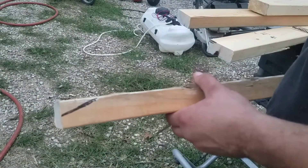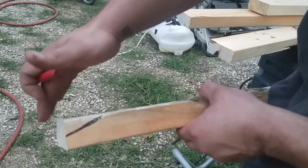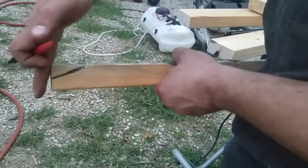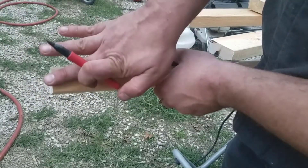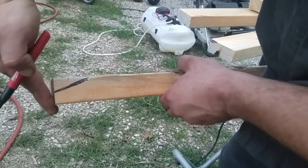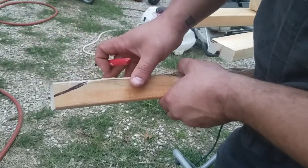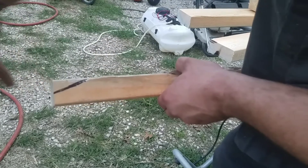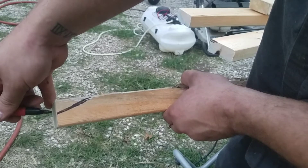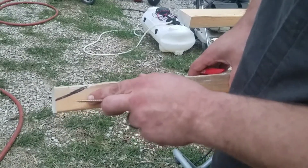The other thing to mention: if your saw isn't cutting square and you're relying on this joint to be square, pulling it this way — where it pulls this piece to that piece — if this isn't square one way or the other, that's the way that other board's going to look. It's easier to drill into the end grain through the other piece and make it square if it's a little off. This way, you have to be a better woodworker.